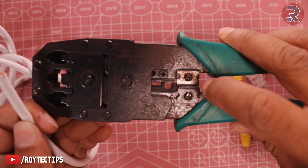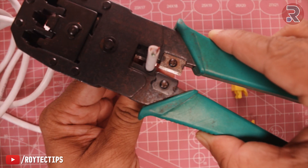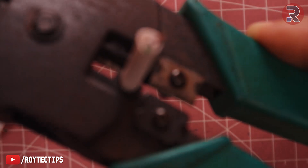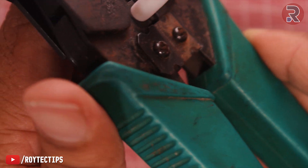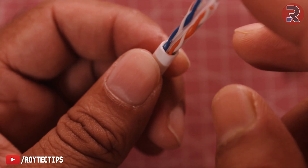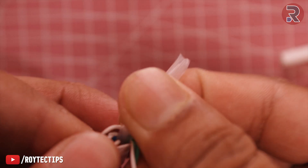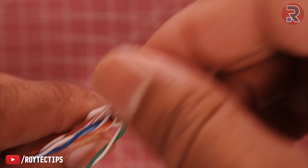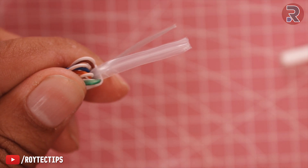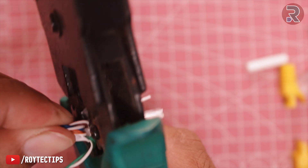As you can see, we have a hole to cut the wires. Put the wire inside this hole like this — let me zoom in. You need to rotate it and the cable jacket will cut. Now as you can see inside the cable we have four twisted pair cables and a plastic separator. We need to cut the plastic separator as well — you can also find some fibers in there, cut everything. Using the blade on the crimping tool, cut this plastic separator.